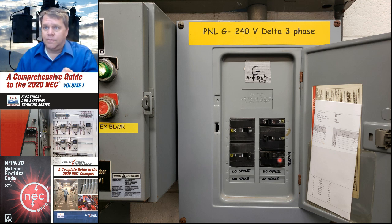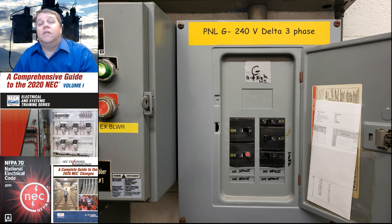This circuit breaker, I took this picture, was a violation. And most of the time that you see a 2-pole breaker on a high leg system, it will be a violation. If you don't ask for a straight rated 240 volt breaker, you're not going to get one. Now, when it comes to 3-pole breakers, I've never seen one that's slash rated, and I don't think they even manufacture slash rated 3-pole breakers. I think with a 3-pole breaker, they're all rated 240 or 480 or whatever would be the applicable voltage.